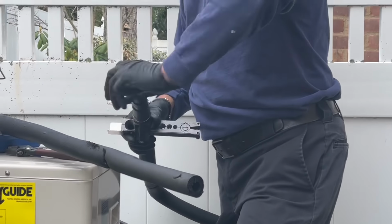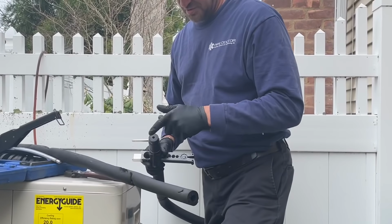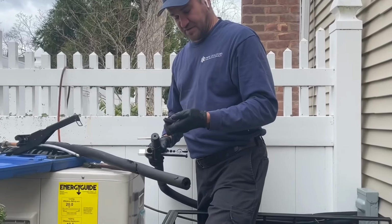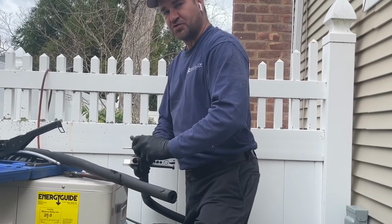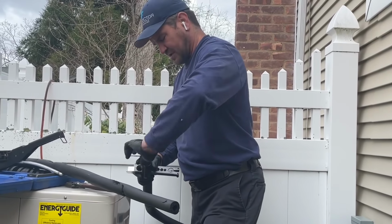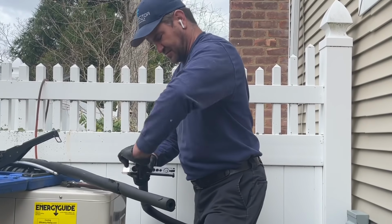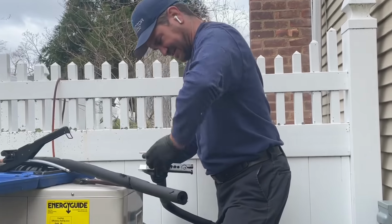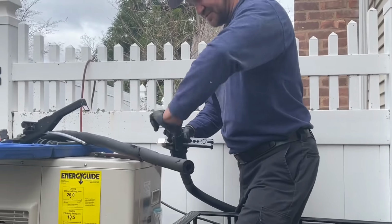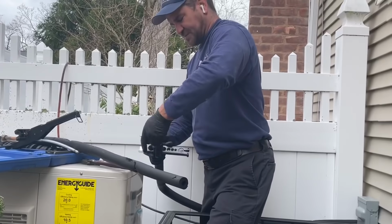And, you know, they do make a drill adapter you could shove in there, and you can use your drill. So if you're doing multiple flares over and over again, you can use an impact drill and get that done. And you don't have to worry about overdoing it because, as you notice, you're going to hear it in a second. There it is. It stops. A little, and then it won't do anything anymore. So now let's open this back up.